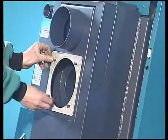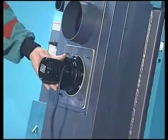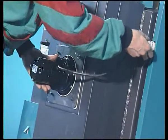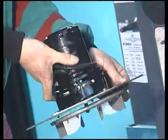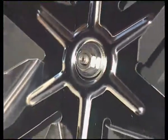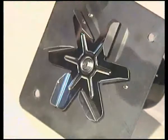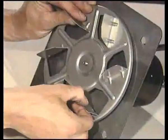The draft ventilator is attached to the waste gas pipe with four wing nuts. The electrical connection of the ventilator to the boiler is with a push-on connector. Depending on the boiler type, the ventilator is equipped with a rotor with a diameter of either 150, 175, or 200mm. If we need to replace the rotor, we loosen and remove the nut with the left-handed thread.